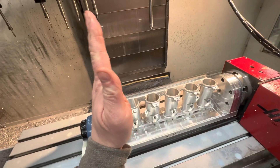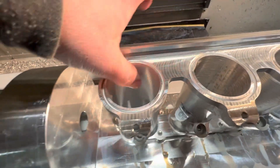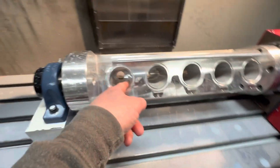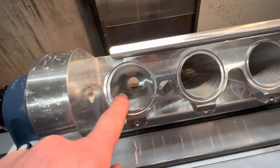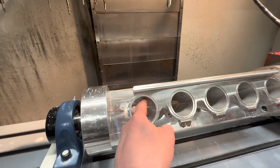There are 15mm rads at the bottom, so the tool should be able to get in. I think what's stopping it is the angle — we tilt it about six degrees back to get the finish we've got now. Our offset is a little bit out, which is why we've skipped a little bit, and our roughing program was too rough. We can sort that out on the next part. We're touching on this side and we've got a half-decent transition, but we're not getting to the back over there.